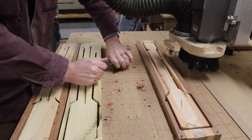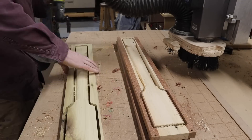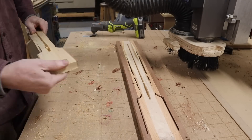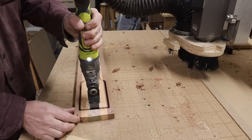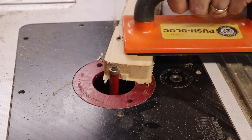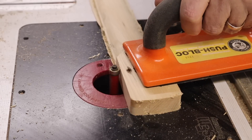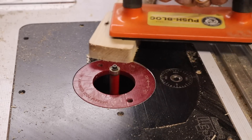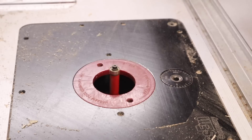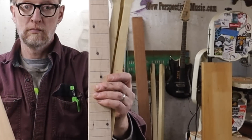The Aspire file has some tabs modeled into it that you will need to cut. I always use these little oscillating tools - they work pretty well. I did put a tab into the heel of it, which maybe I shouldn't have, but you definitely want to make sure you round that off properly on a router because otherwise it'll affect the fit of your neck into the pocket. Don't forget you can't just go and edge trim this whole piece because if that guide bearing goes any further, it's going to not touch wood and you're going to wreck your neck.